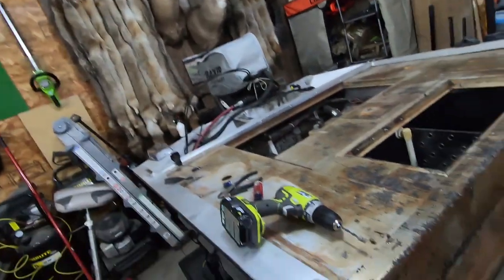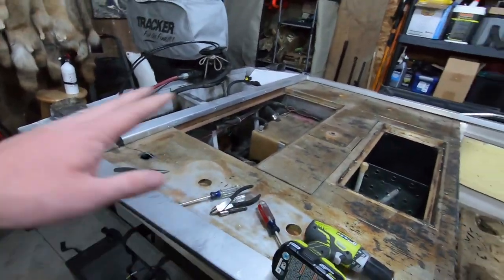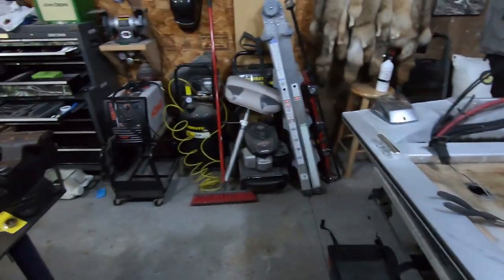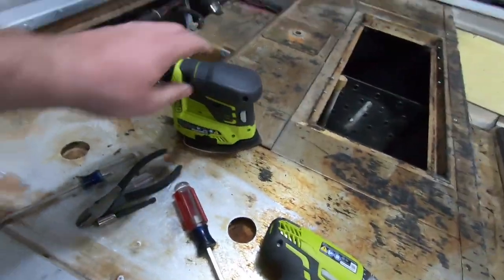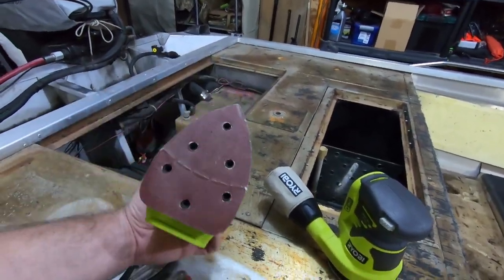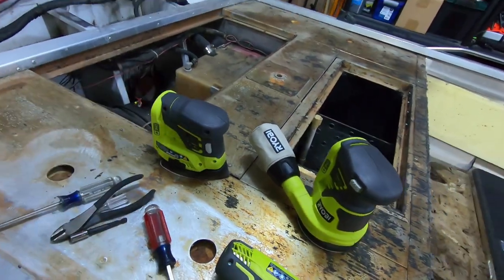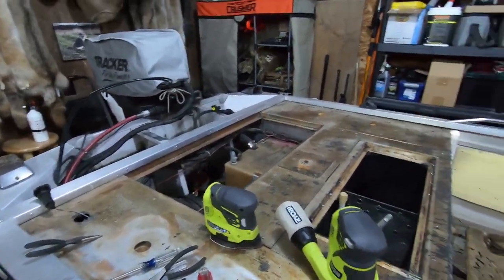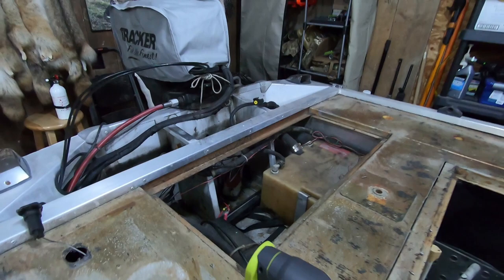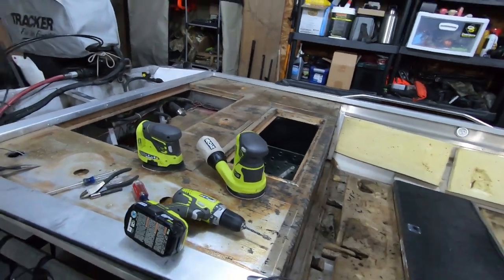The carpet is now all removed and the only thing left is some little remnants and then the glue. I'm going to have to sand all that down and clean it all up. I did a little test spot right here and it actually comes off real good. These are the two sanders I'm going to be using - one is just the standard regular round orbital sander, and then the other one is for getting into the tight corners and tight along the edges. They both work really good. Some of it I'm going to have to sand by hand on the small surfaces, but I think probably an hour on the back deck and I'll have it all cleaned up.